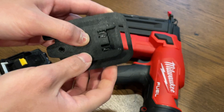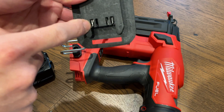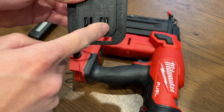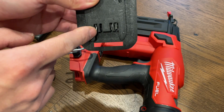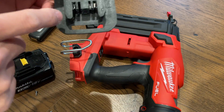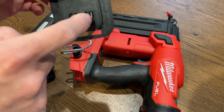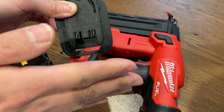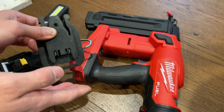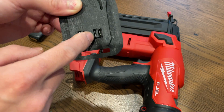In order for the adapter to work you only need three outputs from the battery. This one is the positive, that one is called J2, and that's the negative. Obviously the positive from the Makita goes straight into the positive of the Milwaukee, and negative goes straight to negative. But that's not all — I first did it that way and the tool would turn on but it wouldn't actually function, so I dug in a little bit deeper and it turns out you need this third pin.